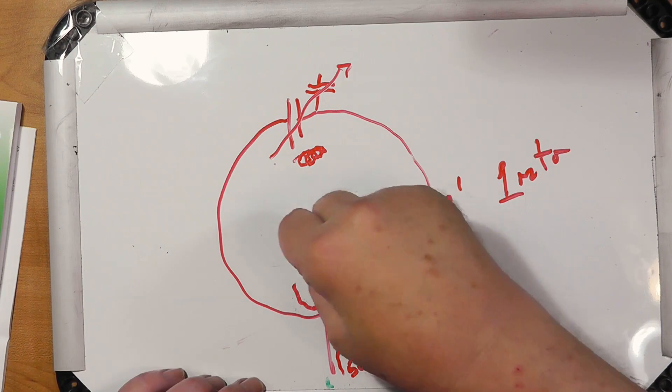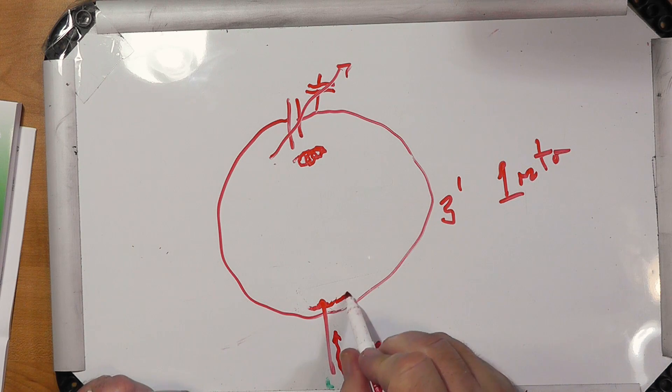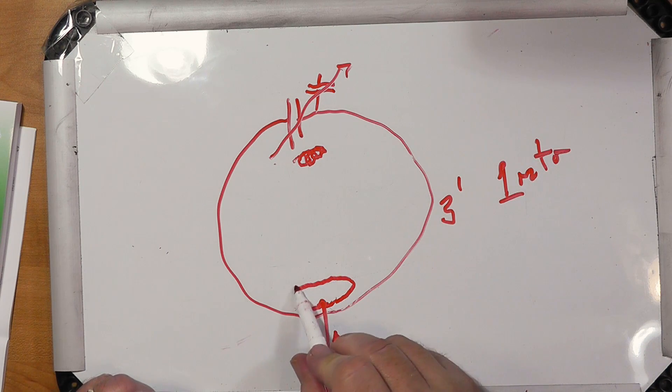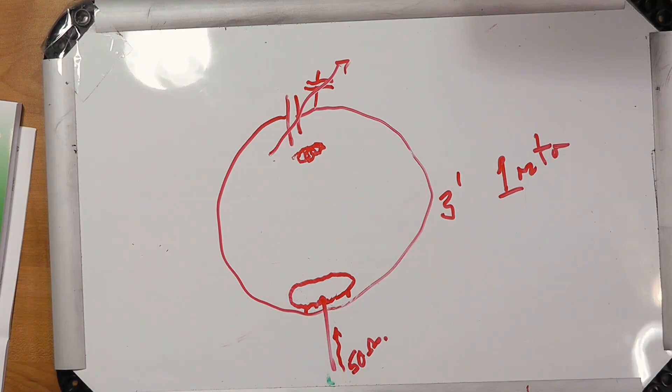The question is about the shape of the driven loop. Most people assume a circle, but the MFJ website suggests you squash it a bit and get it a little closer to the main loop — and that does help, I've tried it. Anything you do is going to affect the Q of the circuit, it's going to affect the bandwidth, which is the great compromise here. But otherwise you're going to get a signal that's just as good as a dipole.